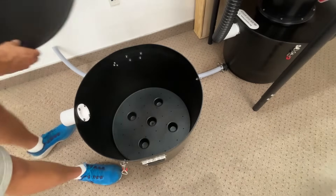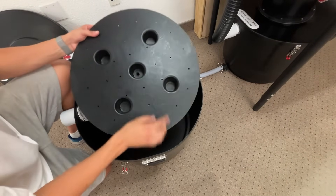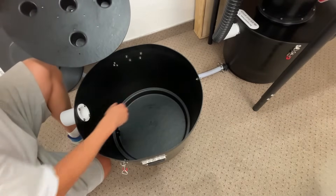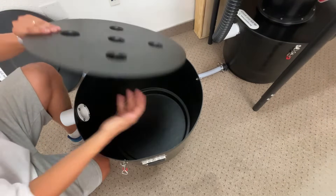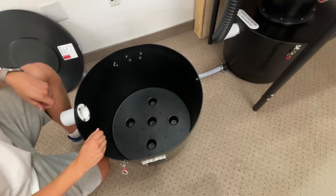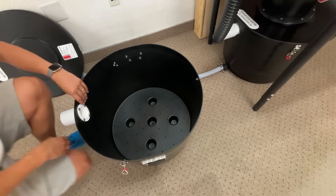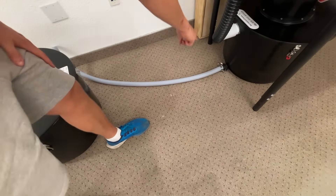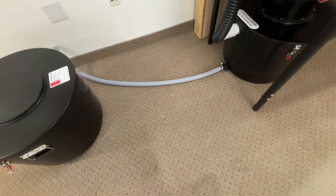The other equally important feature is the double base inside the container. This false floor captures all solid waste, and most urine gets absorbed into the compost. If there is more urine than the compost can absorb, tiny holes in the false floor allow liquid to fall through to the bottom of the container. The capillary feet of the double base stay in constant contact with the urine at the bottom, absorbing some liquid back into the compost to keep it perfectly moist. If there is more urine than can be absorbed and evaporated, an excess liquids outlet at the bottom handles the overflow.